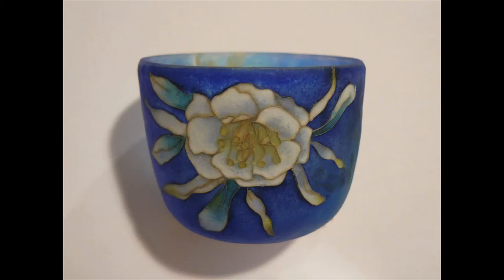Glass, like ceramic, requires slow buildup of temperature and lengthy cooling down in the kiln. Cracking and breakage occur during the cooling period and sometimes during heating, thus wasting a significant percentage. The larger the piece, the more likely it is to crack or break. In addition, when reheated, glass will often slump, distorting it often to the point of total disfigurement. The great Japanese master enameller Takeuchi Chube was the first to make gurasutai jippo — an exceptional achievement at any date, but especially so at the time of his innovation in the late 1870s. He was the only Japanese master to make gurasutai during the entire 19th century.